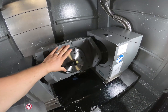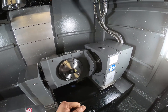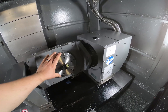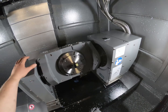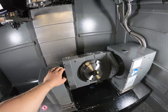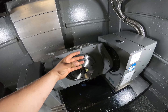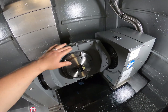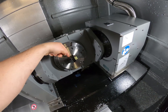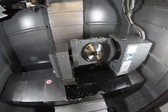We want our work as close to the platter as possible, and that actually helps a lot with rigidity — you don't want to be way out chattering. A lot of fixturing actually moves it away from the machine with a little riser block that gets really thin, and that's because of tool clearance. Here the tool clearance is a concern, but we're lucky to have a smaller platter. Basically the quill can hit the platter, so you want to move your work away to fit the quill past it. But with a smaller diameter, if we have a long tool like a 4.7-inch tool, we can get right over here without worrying about the quill colliding.